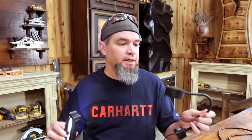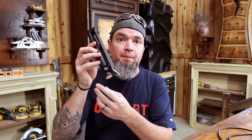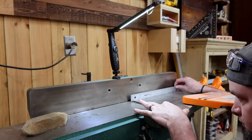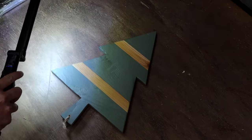Lights. I'm going to show you two of these because they kind of go into the same category but do two totally different things — one's 20 bucks and one's about 14 dollars. The first is a COB light, which basically means it's a strip of lights. It's compact, has a magnet so you can stick it to anything metal, and light up your work surface. Any shadow on your workpiece sets you up for error, and these cheap lights fix that. Cool thing: once you've applied a finish, you can run this over it and it will show you any flaws you can't see with normal lighting.